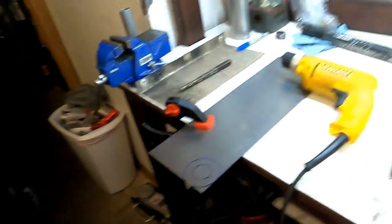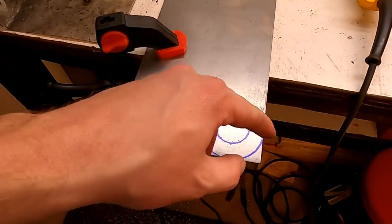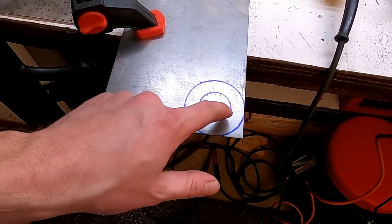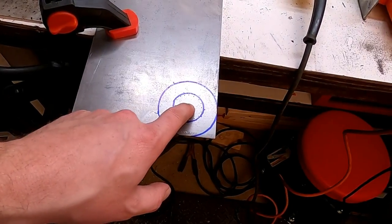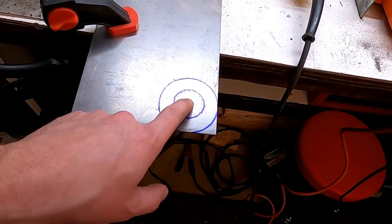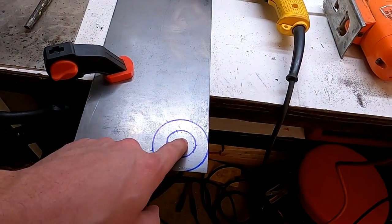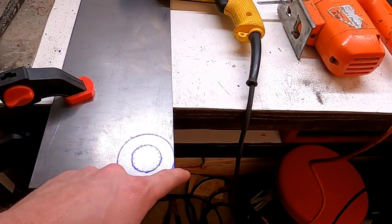I'm an amateur. Before I decided to cut it out, I thought it would probably be a lot easier if we cut out the center hole first. So I marked it and I actually used the piece of pipe that was cut up earlier — went around it and put my center punches around it. And I'm just going to drill a series of holes around it. Hopefully we can get this out pretty easily, and then we'll just use the grinder bits and the drill to smooth out the edges.